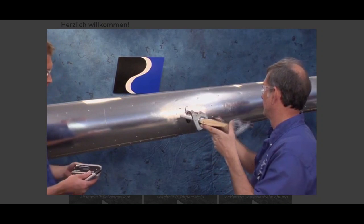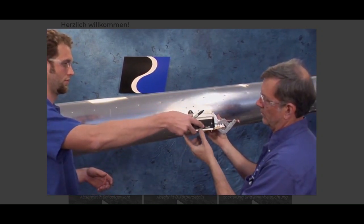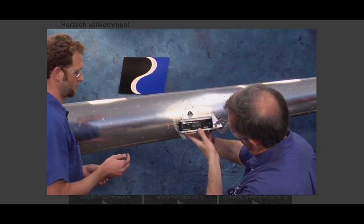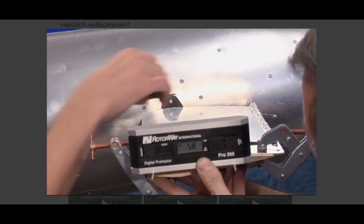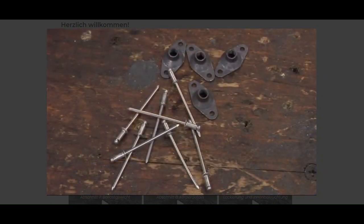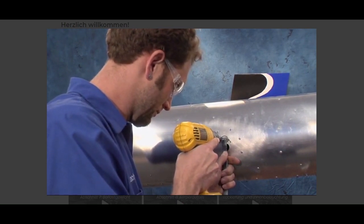Insert the fin assembly into the tail boom and place the level to the end of the fin using the 2 number 30 drill bits as shown. While holding this position, mark or drill through the holes in the trim fin brackets to spot the location on the tail boom. Then remove the fin assembly. Locate the 3/16 inch nut plates for the horizontal trim fin according to the previously drilled holes. Install the nut plates, part number E00-7100, inside the tail boom.